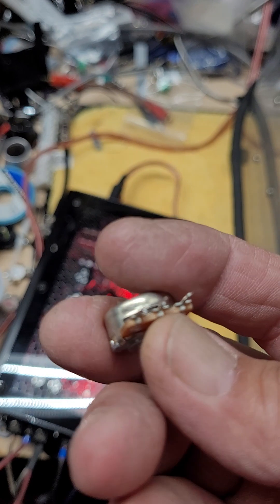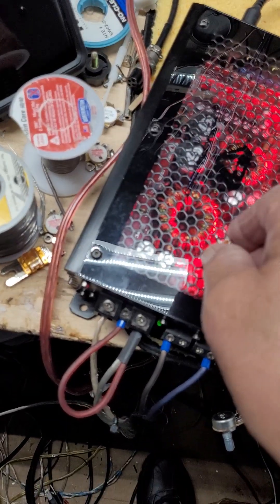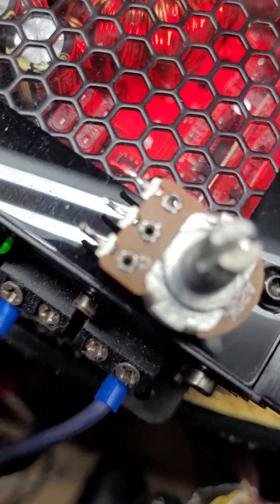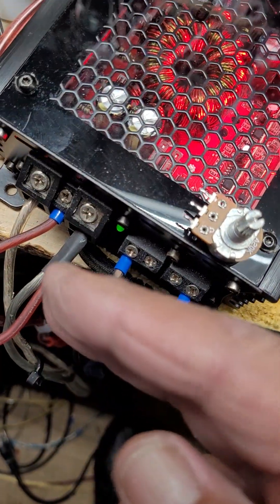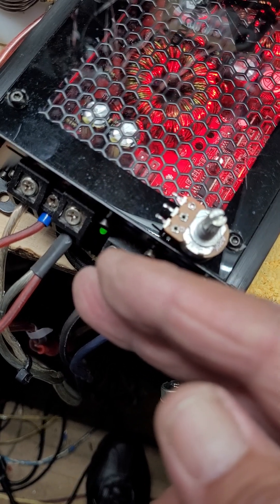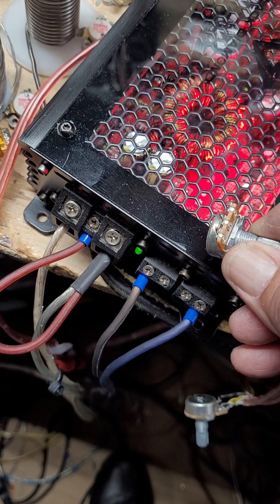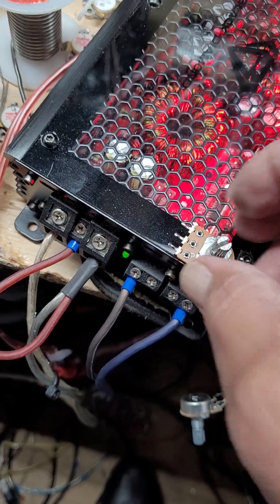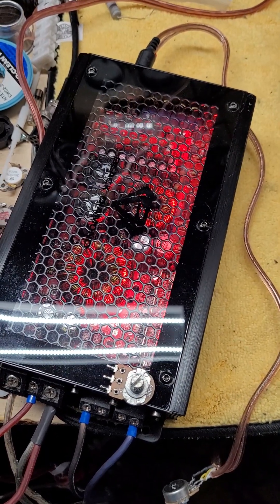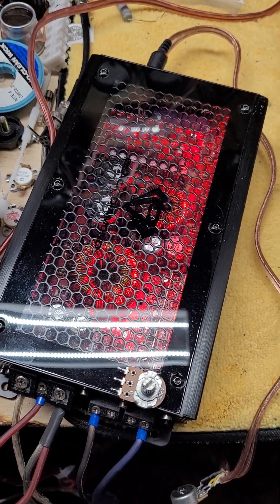Well, I don't know. I mean, you've got a left and right in, true. So if you went stereo, the left is in, the middle is out, the right is ground. If you had stereo, your left and right would be on the front and back tabs in, and the middle tab out — but it's a mono signal with a subwoofer. Most full-bridge amps have just one input, so what do you need both for? Couldn't you just combine them? I don't know if that's right or wrong, but let me try it.